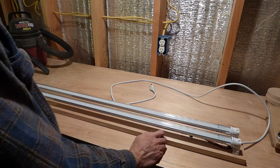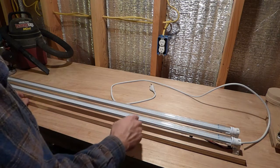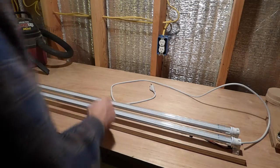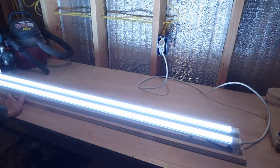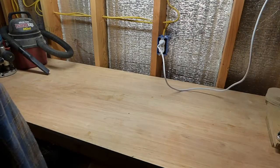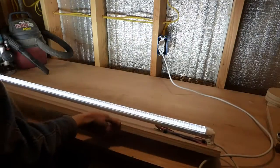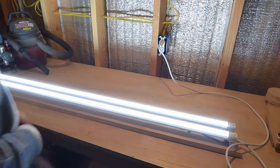These are replacement tubes for the fluorescent T8s, and they have an electronic ballast. What you end up doing is just running power to one side of the tombstones. And that's what I've done here. I've just made a simple fixture, and I think it's going to work pretty good. It's pretty bright — see how it lights up the workbench versus what I've got now. Nice, natural color. Nice light. I'm going to show you how I made this out of just scrap stuff I had laying around.